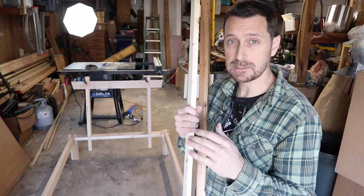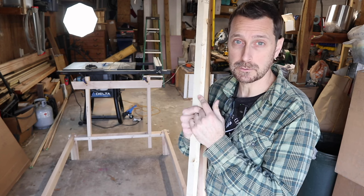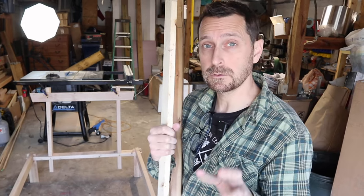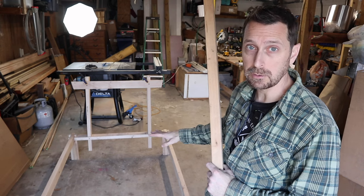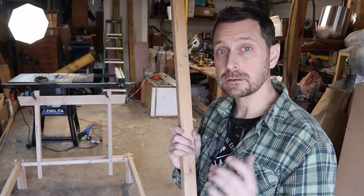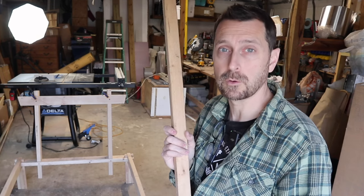And then for the support slats that run across, you can either buy these 1x2 furring strips or again cut these out of a 2x4. Whatever makes financial sense for you to do, do it. Now you can also choose to put a piece of plywood down in the middle for your support for your mattress, but the edges are going to be resting on the side rails. Again, that's another design aspect that I will leave up to you, whatever you feel is best for your needs.